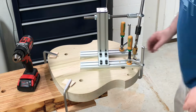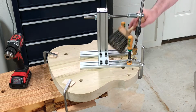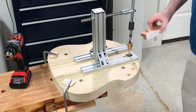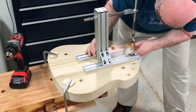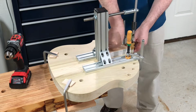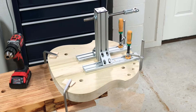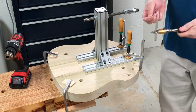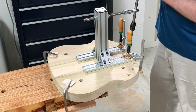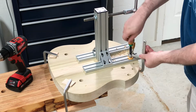And this is the number 2 spindle at 8 degrees, and it's just that simple. And now we're moving on to the number 1 spindle, and that is at 7.5 degrees. So use our angle gauge, set that up, lock that down, and here we go, drilling that. Now right here I am going for a little wire tie just to clean out the stop collar between the flutes, make sure there's no gunk in there, and we drill that out.